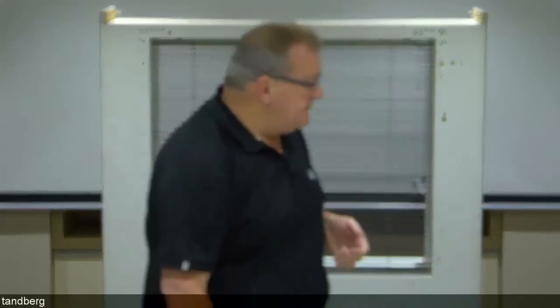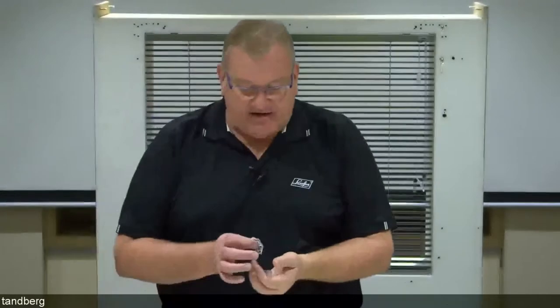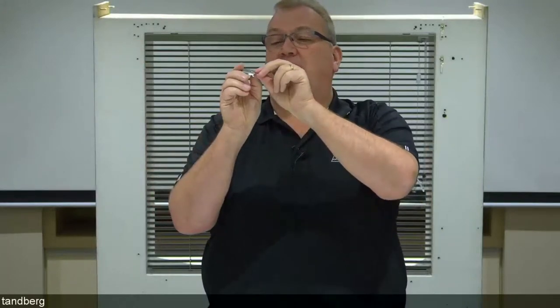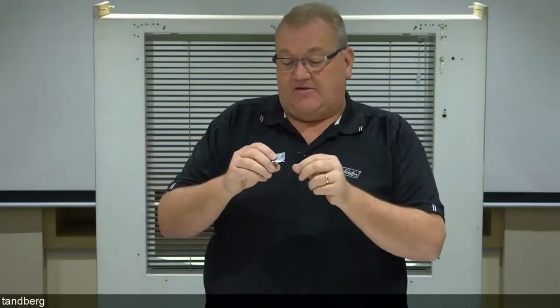Now, what we've got behind me here, we've actually pre-installed a 25mm standard slimline Venetian. I just want to talk about a couple of things here before I pull that down. We actually have what we call our standard bracket. The standard bracket for you to fit a micro or a slimline Venetian is the one bracket whether I'm top fitting or face fitting. It's a nice, simple, spring-loaded bracket. When I remove that shade blind from behind me, you'll see that it's just a quick push in and pull down from the back, and the head rail drops out of the bracket. It's nice, simple, easy to fit.